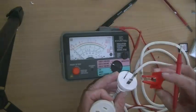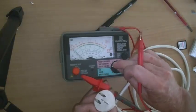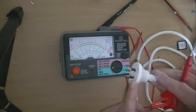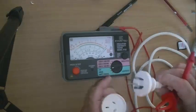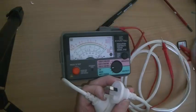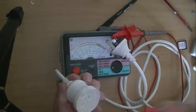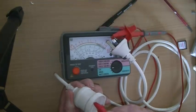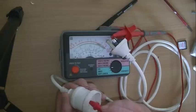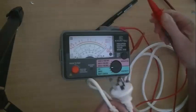For checking the polarity, you can do it on either scale, but it's better to do it on the 3 ohm. Remember the rule: plug in your right hand, earth to the ground; socket in your left hand, earth to the ground. Connect your probe to the active, press your probe in the active, and that polarity is correct. And that's all the tests you need to do on a lead.